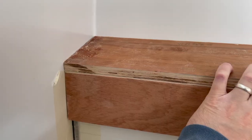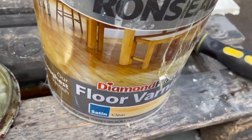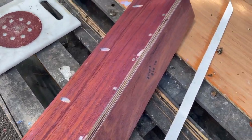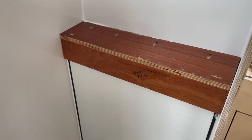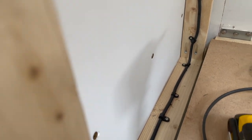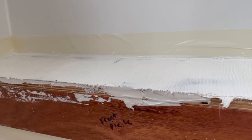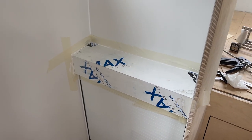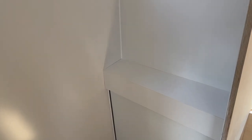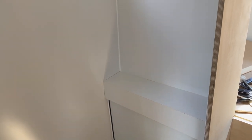At that point I could see that it fitted, so I varnished it with three coats of varnish — just stuff I had knocking about — let that go dry, and then into the van it went. I was going to fit it with pocket holes, but then Dave gave me a great idea to screw it through from the back so in future I can remove it if needed. It was then masticed up with PuraFlex 40 and iced over like a cake. Then we installed some sani clad over the top and siliconed it up with sanitary sealant, which stays nice and white and won't go mouldy.